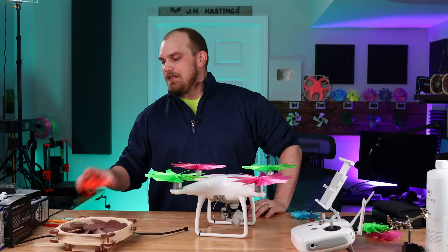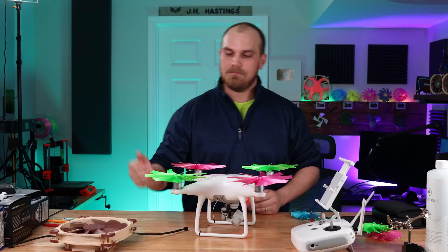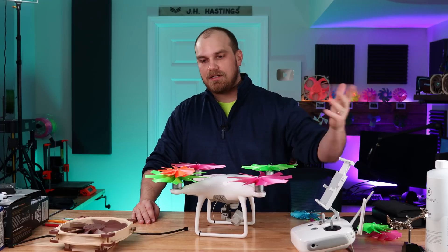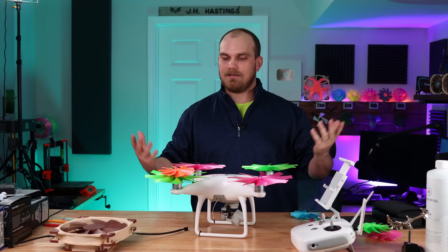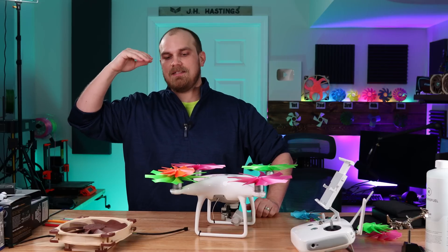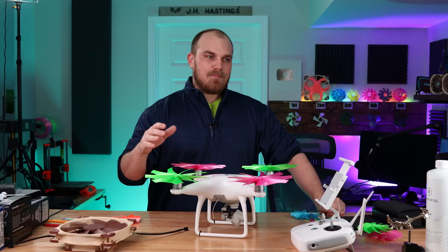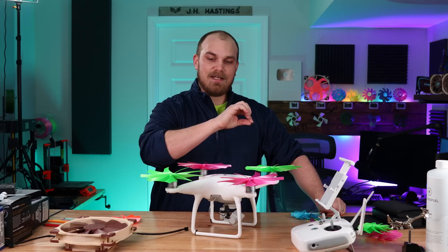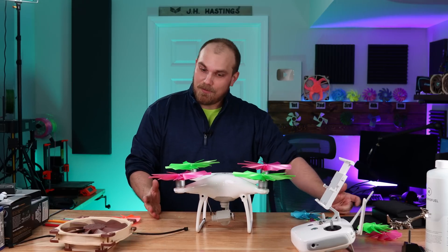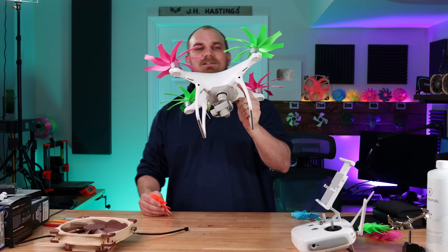We had to go to a larger fan, going back to the 120mm. I still believe it's unlikely this specific drone will fly well with these fans, mainly because I can't get the motors to spin fast enough to produce enough thrust from this fan design. I was actually getting an indication on screen that the motors were reaching their max RPM, so it was protecting itself from burning up. On a custom-built drone, I'd just throw in a 4S battery and step up the voltage until it flew or burst into flames — but you can't do that with a DJI. Also, based on my past PID tuning experience, I would have probably crashed anyway on a custom drone. The flight software is so good that even with how unstable it was, it was flyable. It was a bit breezy and these giant fan discs were getting pushed around, but it didn't crash. Have a good day.